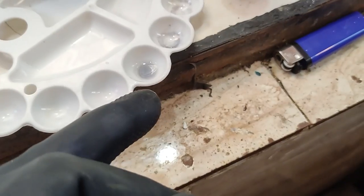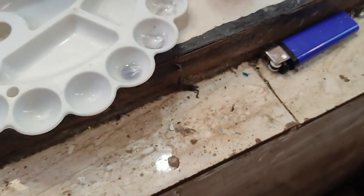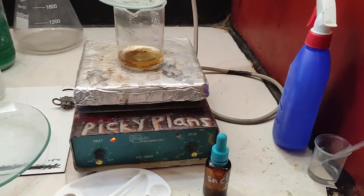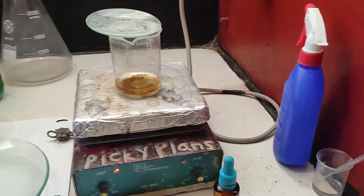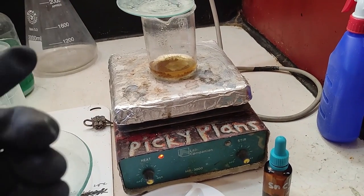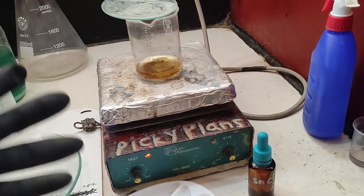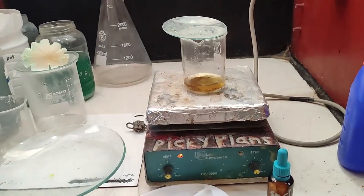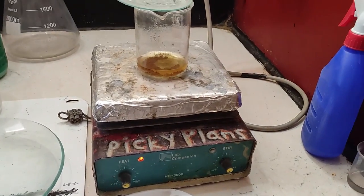As you observe, there is just a little bit of gold dissolved, so we shouldn't just pour the liquid away, or even put it in a stock pot, before testing. It's possible to precipitate gold while it's being cleaned. You can add a reducing agent like SMB or oxalic acid to keep your gold out of solution, and also clean the gold powder at the same time. This is the cure for this phenomenon.